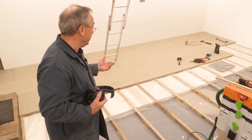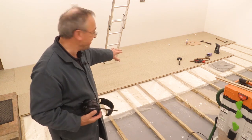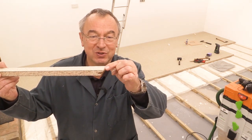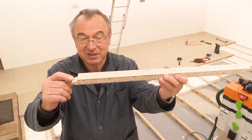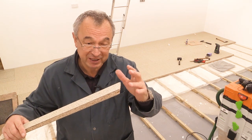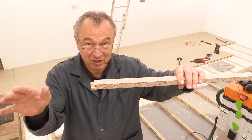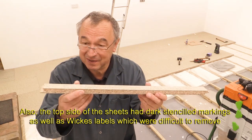I think we're making really good progress now. I've got three layers of sheeting done — one more layer and this half of the workshop is done, so I'm really pleased. I just want to mention the way up that the chipboard is being laid. According to my research, it should be laid with this sort of lip on top so that it closes up nicely. But all the damage to my chipboard has occurred on the edge that would show — it came on a big lorry, lifted off by forklift on a pallet, and there's been a lot of damage. So I'm laying mine the other way, so any damage to that part gets lost. I haven't found a single case where these other edges have been damaged, so I think for me that's the right solution.